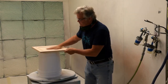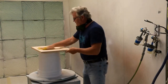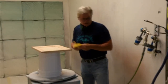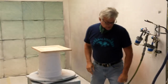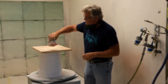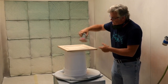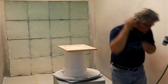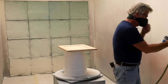So I want to spray this maple door quickly, and then we can move on because daylight's a burning. Again, really nice quality, solid maple doors. I'm going to sand the one door. I use the cabinet grade sander that we have from Surf Prep because of the way these profiles work. I'm going to sand the door with this, but I sanded this door with this sander here, okay? And I'm going to spray, and then we'll talk in a minute. Again, stain blocker.